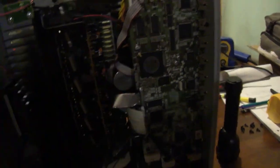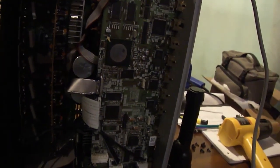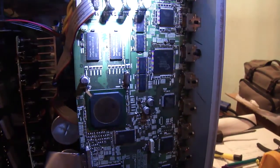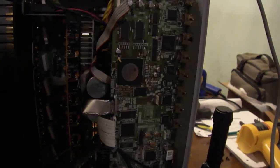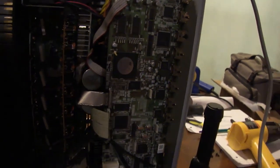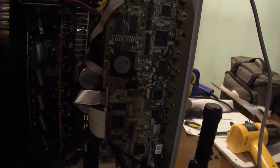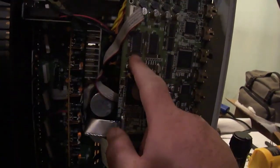This is the digital board. There's a main processor here with the firmware that boots and probably runs this thing. And just like anything, when you're messing with digital electronics, especially to this magnitude, there's a couple RAM ICs up here. Just like computers, man. Computers have removable SIMM and DIMM memory modules that go bad all the time. I'm sure people that have had computers have had to change a stick of DDR3 or DDR4 every once in a while. Same difference here. This is probably SDRAM, and one of these two could go bad and cause all kinds of problems.